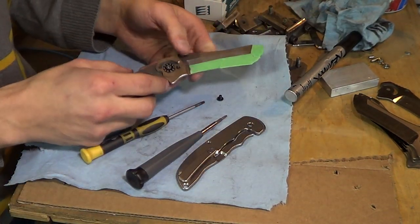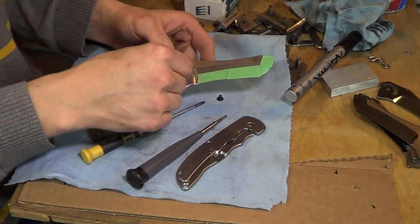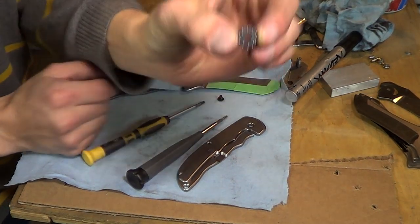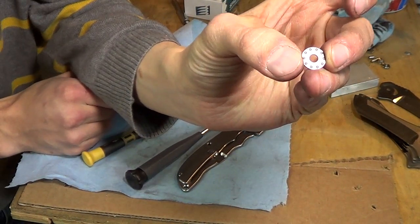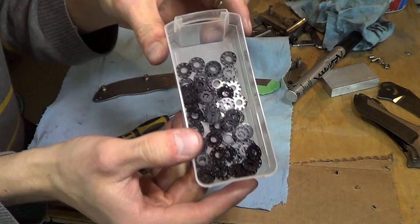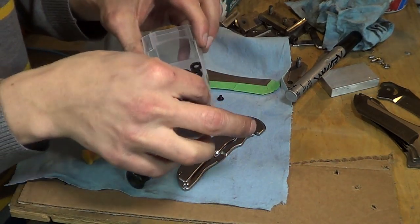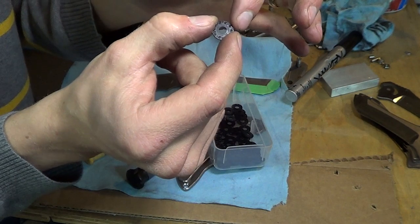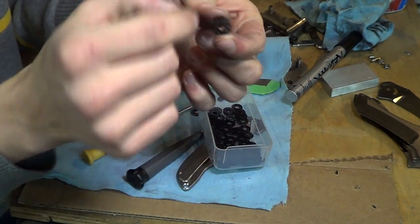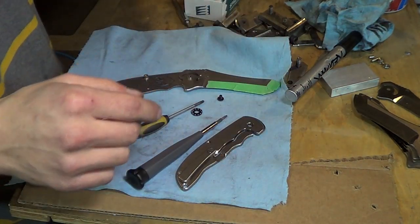Super secret guts inside. I don't think I mentioned anything in this video, but I made a special video all by itself about how I made these. Don't believe me? Oh, I did. I made my own bearing cages. 1/16 inch bearing balls go inside, 10 of them. Fits precision on a 3/16 pivot. They're awesome. They're super awesome. Stay tuned for that video.